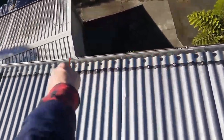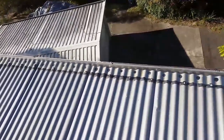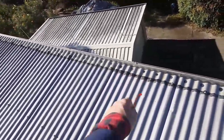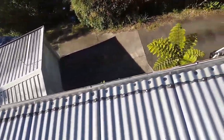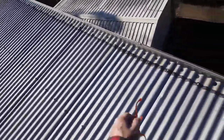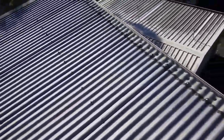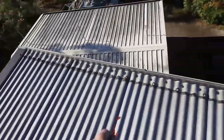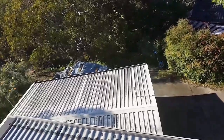Don't forget to clean and paint or apply silicon inside the gutter before putting the plastic capping on, because once the capping is on you may not be able to get to the gutter. I can recommend the silicon after a year — it looks the same as when I first put it down. I would recommend sandpapering the mating surface underneath to provide a better bond. I wouldn't use roof and gutter silicon — use wet area bathroom silicon instead.